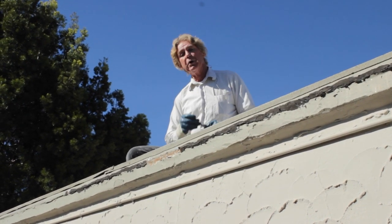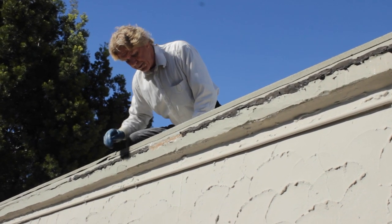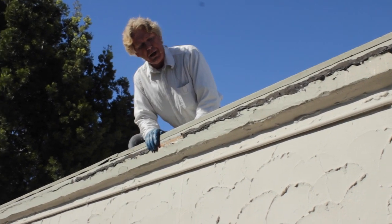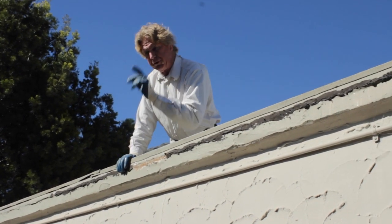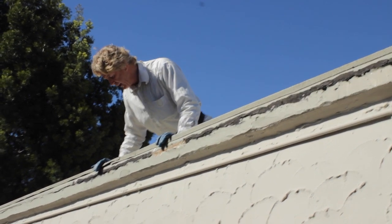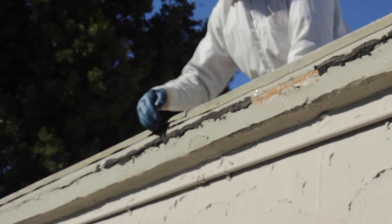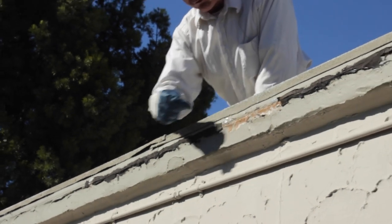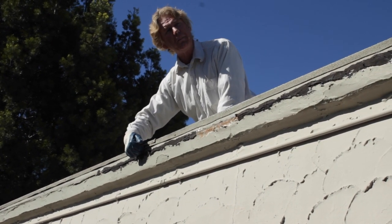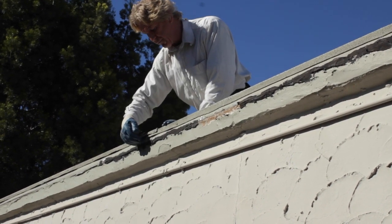Here's what we're going to do — here's what you guys should do if you encounter this. We're going to use a powerful caulking. What they don't know is you see this area here — they put this roof membrane over here and put a nail in it, a few nails. This area right here is a humongous gap, and they're all the way down — humongous gaps everywhere where you could stick your fingers in it.